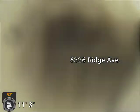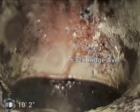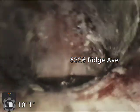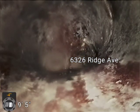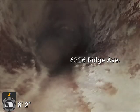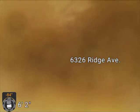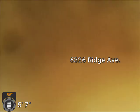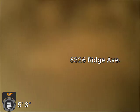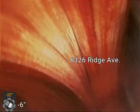So this is probably an old downspout line that they converted into sanitary, because in this area they are allowed to; storm and sanitary lines are combined. So they converted an old outside downspout line when they did some additions and just used this line as another sanitary line for the bathroom upstairs. That looked good as much as I could see, but I'm going to have to actually pause the video now and go in from the other full stack. If you come through the basement door, it's just to the right behind the stationary tub.